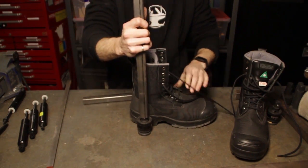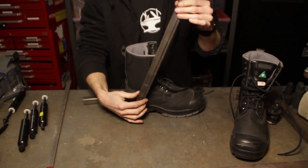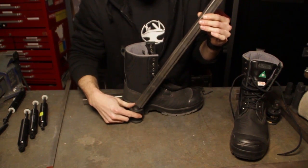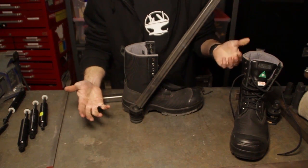The next thing we need to figure out is we have to limit the range of motion of the ankle, because the ankle isn't locking. As you can see, there's a limit here that hits, but we don't want to actually force that, because we might damage the joint. So we're playing around with a few different ideas.